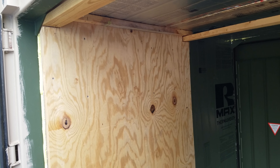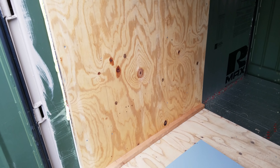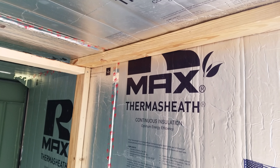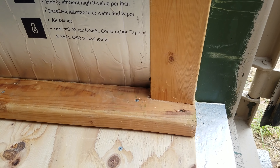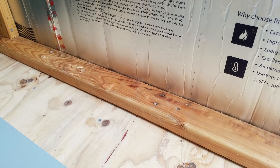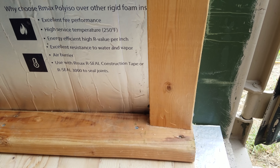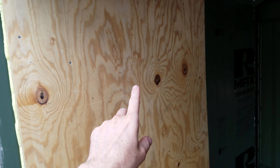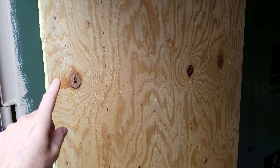On the left side I got one of the walls put in already. It is definitely solid built and will not have any trouble supporting any kind of weight. On the right side you can see how I did that. I have one 2x4 laying flat on the floor screwed in at about five different locations. For the studs I have the 2x4 turned on their side just to provide a slightly lower profile. On the left side I have five studs in the wall lined up with where I want to hang some of the equipment. I just covered it with a sheet of 3/8 inch plywood.